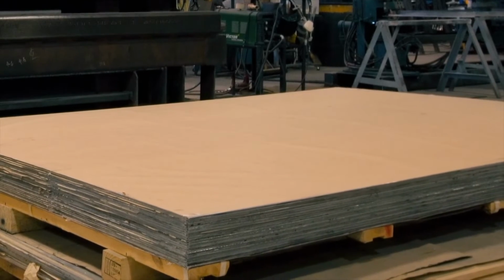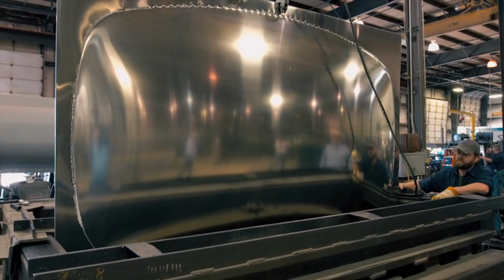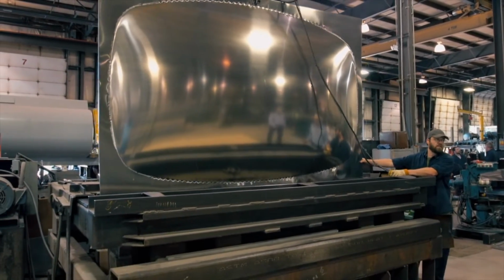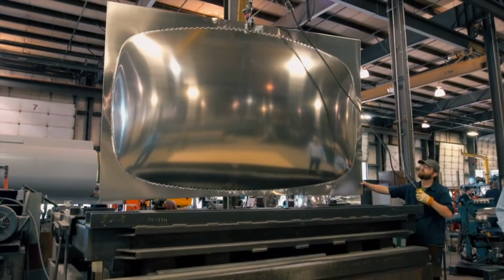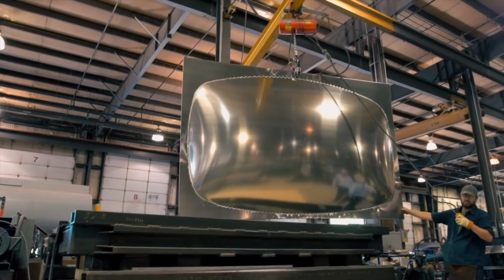It's picked up with a crane, dropped into this machine right here. The hydraulic press comes on, develops up to 30,000 pounds per square inch. At that point, it automatically flows 120 pounds of air pressure against that sheet, and it forms a concave surface.